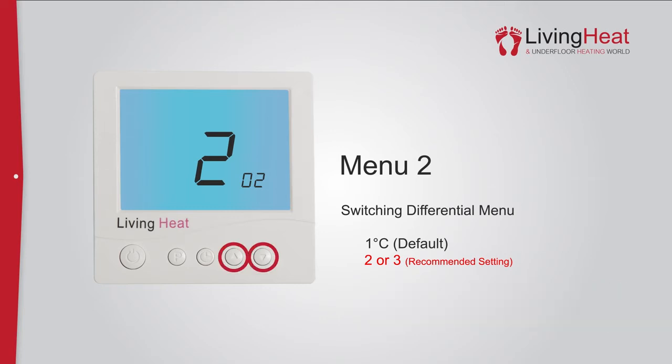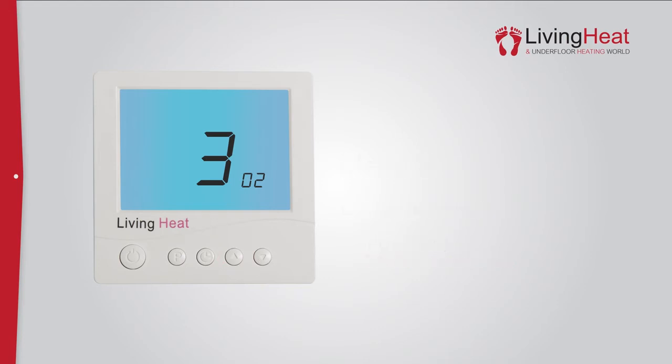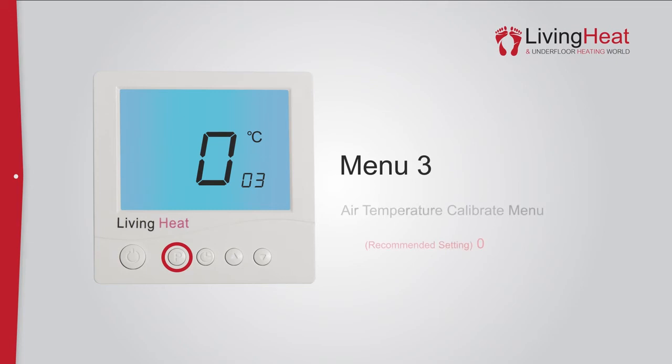Using the up and down arrows to select your desired setting, we recommend setting this to either 2 or 3 degrees, and once you're happy, please use the P button again to move on to menu 3. Menu 3 is air temperature calibration. This allows the user to recalibrate the air sensor should it become inaccurate. Unless you are an experienced user of this thermostat, we recommend leaving this setting on 0.